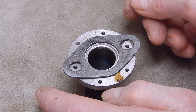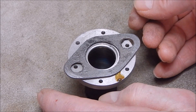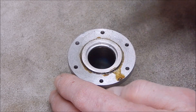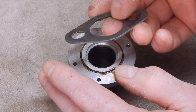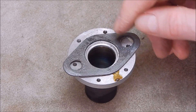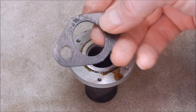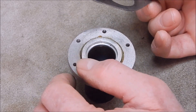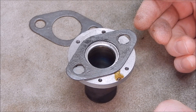That should do the job, so I don't have to do very much work at all really. I'll seal this in place with some gasket cement on this side so I can pull it up and still separate it later if I need to. So the first thing to do is machine up this aluminium locator so the gasket will just drop onto it — just a little bit less than the thickness of the gasket. Once we've done that we'll trim it and put it all back together again. This should be enough insulation to stop the heat transfer. I could even go down more and use both gaskets, but I think one will be enough because we're not talking about a lot of heat here.